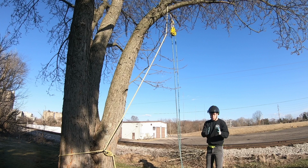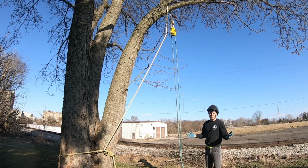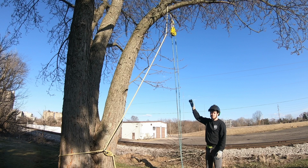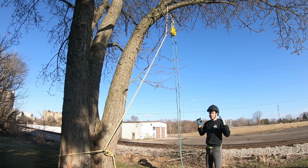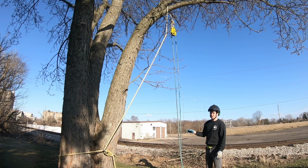It's 2 to 1 that's hanging on a 2 to 1, which means it's going to end up being 4 to 1. So the reality is there is some friction up there, so it's probably not going to actually quadruple the numbers, but we need to plan like it is. We need to know that we either need to pick a big enough union or not rig super huge pieces off of this system.